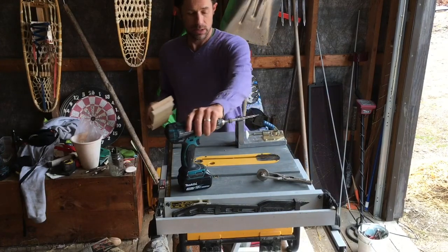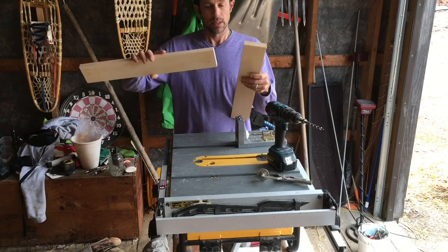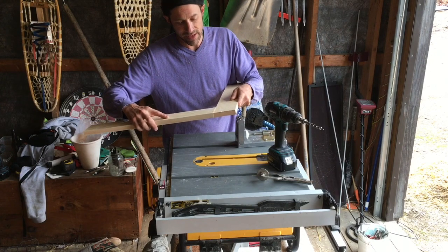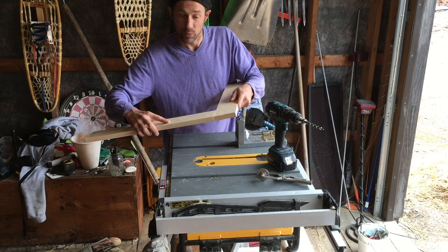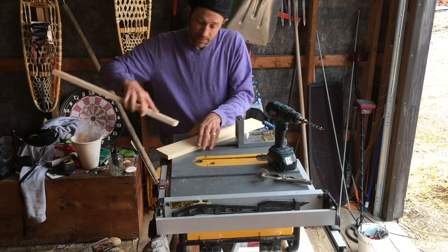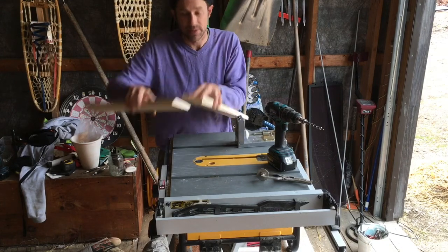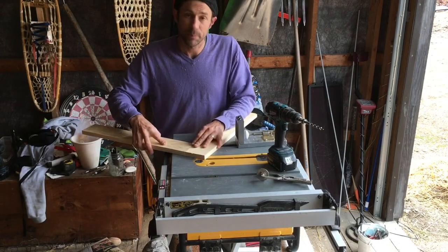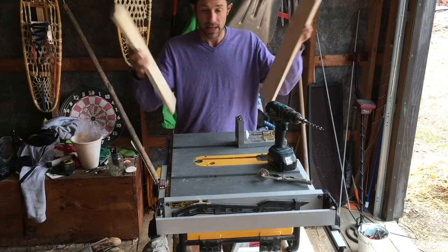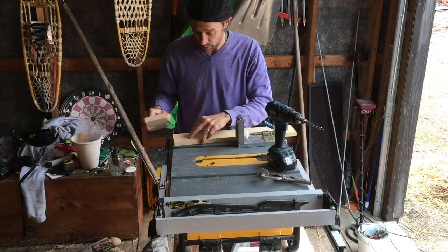I will be joining two pieces of wood as if by magic. The pocket jig is used to create a hidden fastening on the back of the wood. So what I'll do is I'll drill these slanted holes through this wood so that when the screws go in at an angle, they don't come out the front. And they suck it in and the glue joint sticks together real well. And then I can do that on all four corners and have, just like I built, a box or a square to set on my box for the finished product.